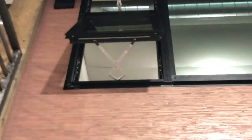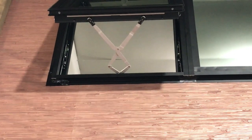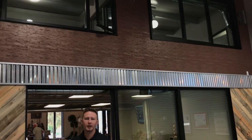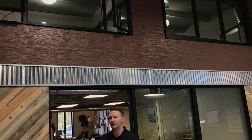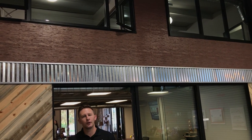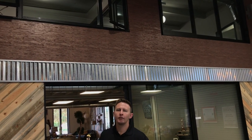Let's go around and talk about the nailing fin — we left it exposed up top. For ease of install, and this is also a huge component of weather and sealant, the nailing fin allows you to put this flush up against your exterior wall to provide ease of install when setting a picture window, an operating window, or even a door frame into an opening, getting a flush, tight seal to your exterior wall. An equal leg will do the same thing but allows for a little bit more adjustment, without that exterior perimeter wrapping around the opening. These are just different options in the construction field — not everything's perfect, so we want to be able to adjust and mold with you depending on the opening you have and the type of construction you're working on.